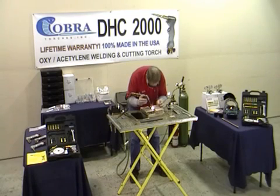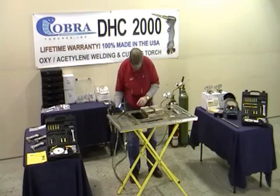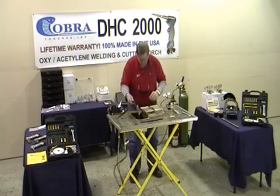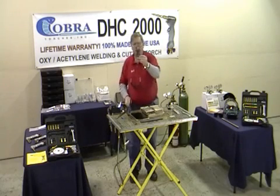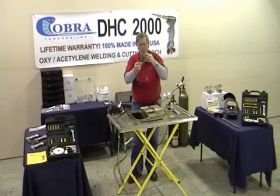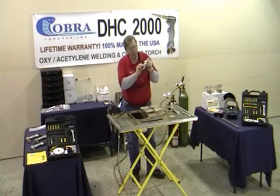So if you want to do patch panels on your car, put in your street rods, your old tractors, grain wagons — nothing better on the market, even better than doing that patch panel with this torch. It does a really nice job welding. If you look down at it, it doesn't warp and distort the metal. There's the penetration on the backside. That's a soft weld — you can hammer it down flat and grind it off, or bend it, form it, shape it. You don't have to use a hard grinder. It just adds heat back into what you're doing.